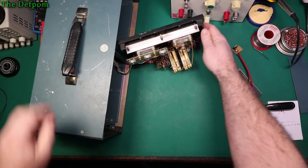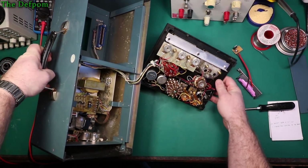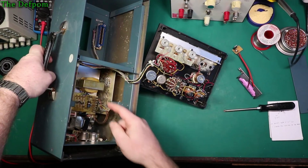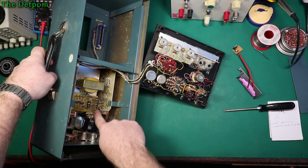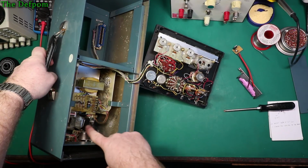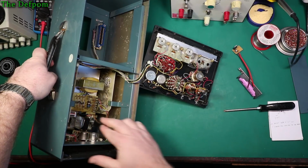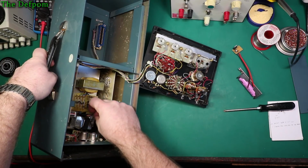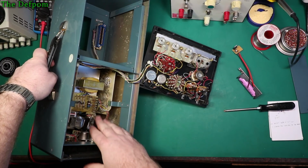And there's the insides. There we go. And there's the battery packs. All in the back there, behind that metal plate is battery packs. Transformer, charging circuitry here. And this is the distribution for the power from the battery packs. There's the D-cell holder right there, where the Mercury battery normally sits. And when I got it, there's a battery in there, which had been leaking. And it's corroded off the bottom terminal, just here.